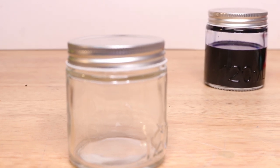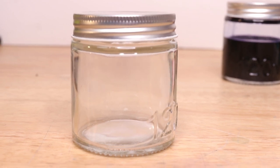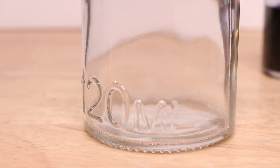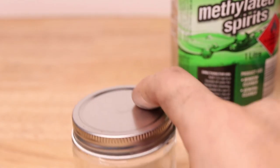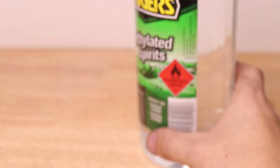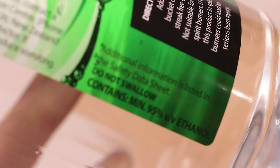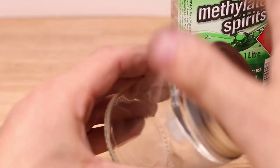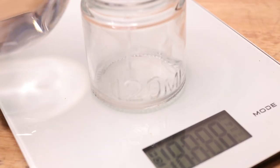You can get small glass jars for about 50 cents each, and you can get jars with brushes attached to the lid for easy application, but I prefer to use paint brushes for applying it as the ones that come with the jars aren't all that high quality. The shellac will be mixed with denatured alcohol, or in Australia methylated spirits — a 95% ethanol mixture that should quickly evaporate when brushed on. In Australia methylated spirits goes for about $4 for one litre and you can buy it from most grocery stores or hardware stores.